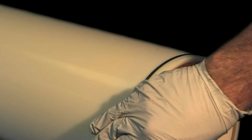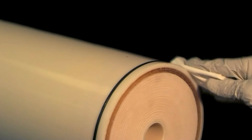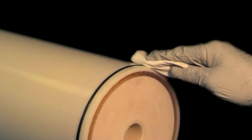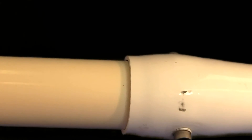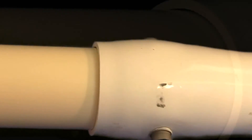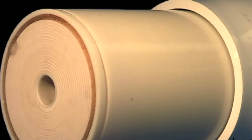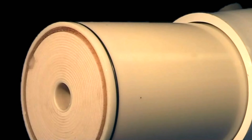When applying this solution, care should be taken to avoid exposing the hollow fiber membranes, which are uncovered at the end of the membrane contactor cartridge. To reduce contamination risk, replace gloves, and using both hands, insert the cartridge into the contactor approximately three quarters of the way. Install a large O-ring to the end of the cartridge that is exposed from the contactor, ensuring the O-ring is properly seated in the groove.